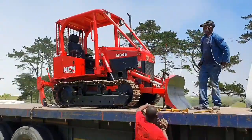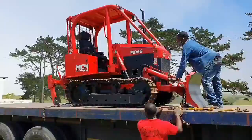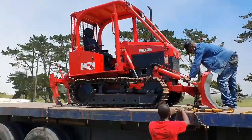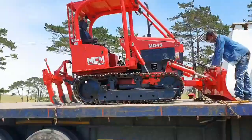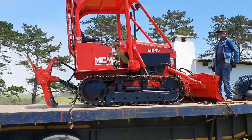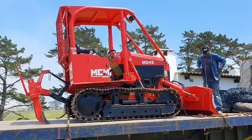You can fit it with a blade and the front loader, and at the back obviously any implements working with a three-point hitch. Lifting maximum 750 kg at the back, and also fit it with a two-speed PTO. The little dozer weight is three tons.